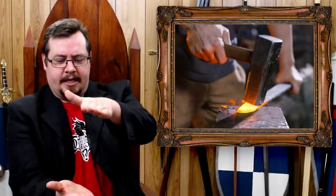If you can control the rate at which the iron cools down, you can actually manipulate what is happening with the iron and the carbon. This is very important because depending on how the carbon ends up being distributed within the material will dramatically change the properties of this steel. Think about how many other materials can be affected to such a varying level — it's amazing.